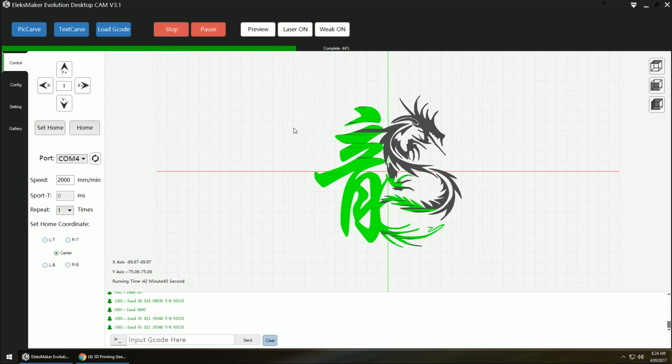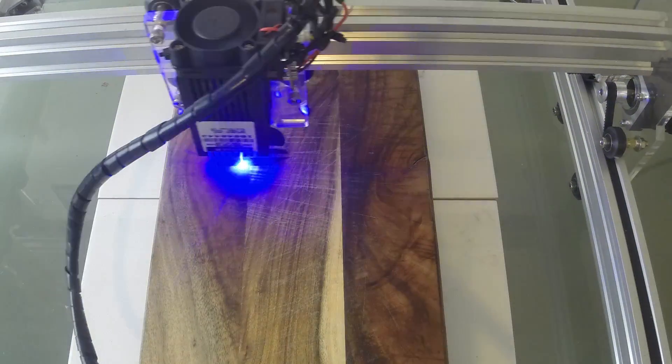The software is called LX Maker. Basically, what you've got on screen is what I'm engraving now, and the time-lapse will be coming up. The green is the laser path where it's already been; the black is where it still has to go. You can control your axes manually, just in testing to make sure it's all good. Manually disable your steppers, move the laser to the central point of your bed, and then you can set that as your home position and it will always home back to there. Up here there's a cool preview option — once you click that, the laser will move around on the actual unit to show you the total maximum size of the engraving.